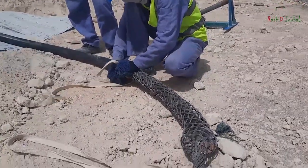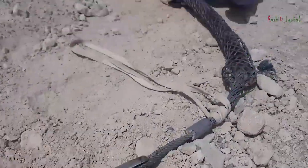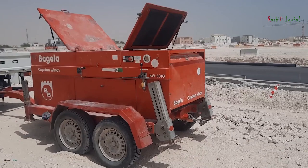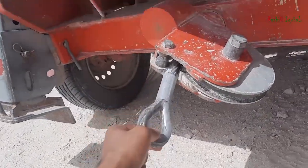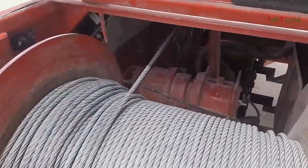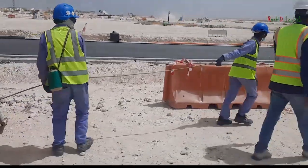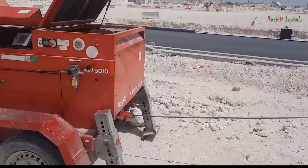This is the hook of the sock where the steel wire is to be tied. This is the cable drum which is kept in the cable trolley. The cable trolley is placed on one side and the winch machine is placed on the other end. This is the winch machine — this is the hook of the steel wire where the cable sock is to be linked. Inside this winch machine is a steel wire drum with a length of around 500 meters or more. The operator has started the machine in the forward direction and these people are taking the steel wire towards the cable drum side through the trench.